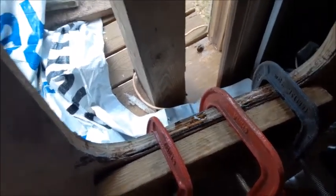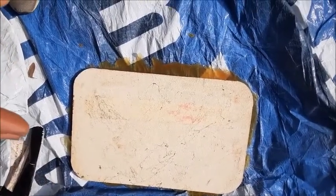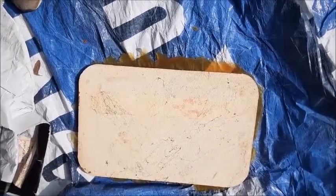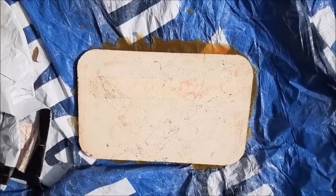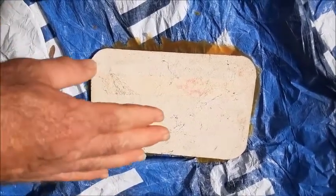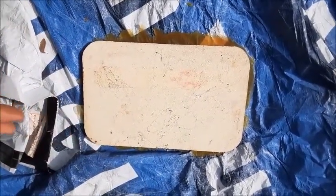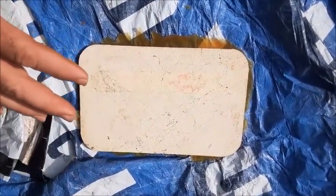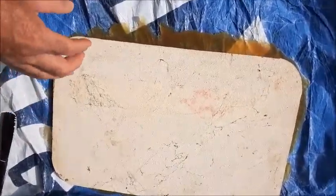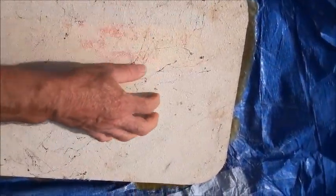We went ahead and glued the piece of gel-coated fiberglass that we cut out of the deck onto its new piece of plywood. On this one, we did not use the fiberglass mat between the two pieces. We just poured the gel coat on top of the piece of plywood. We used a brush and painted it back and forth, and also painted it on the back side of the gel-coated piece we cut out of the deck. Then we poured a big pile of it right in the middle and put a big flat piece of weight on top of it. After it dried, it doesn't seem to have any of those air spots on it like the other piece did when we used the fiberglass mat underneath.